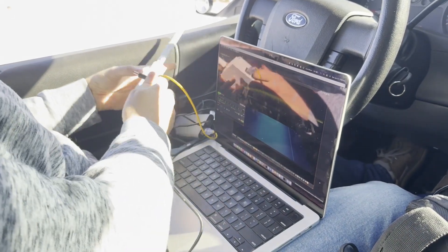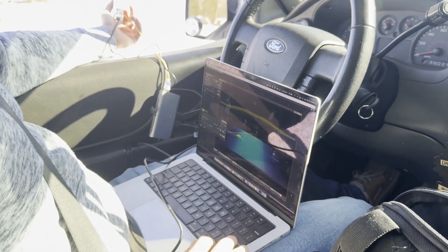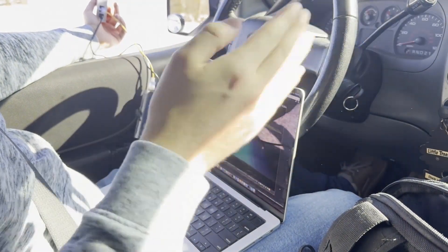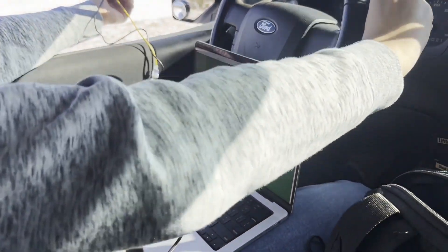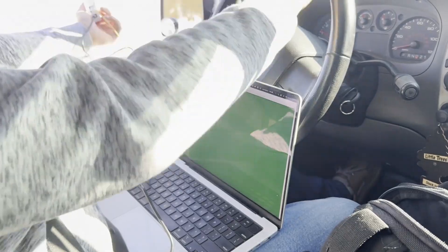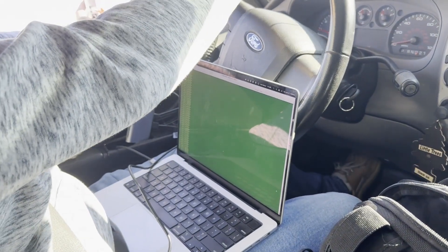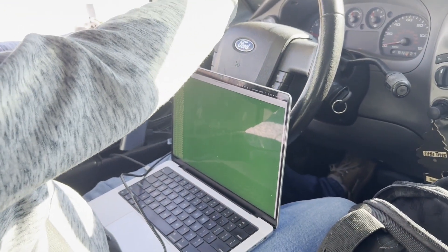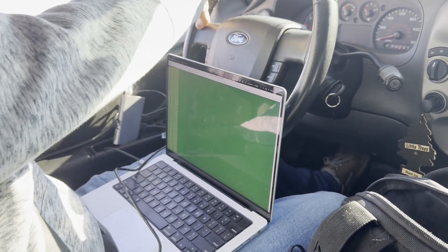Let me power it back on and put my SDR right here. And there are the spurious emissions. What it does is frequency hopping — it'll probe several frequencies until it finds the transceiver. I'm going to move on further down and see if we can get anywhere. I've also got this at 500 mA on 5 volts, so it should theoretically not be getting as much power as it needs — it needs 1 amp. And now we're really through the thicket, so I don't know if it'll work at all back here.